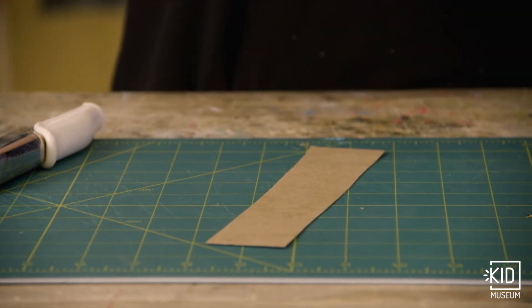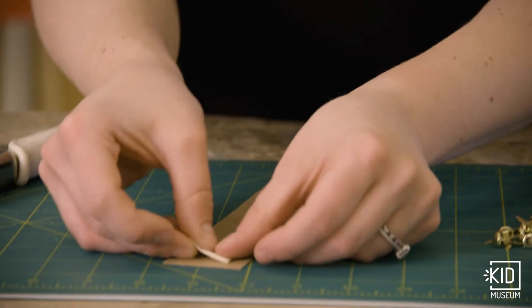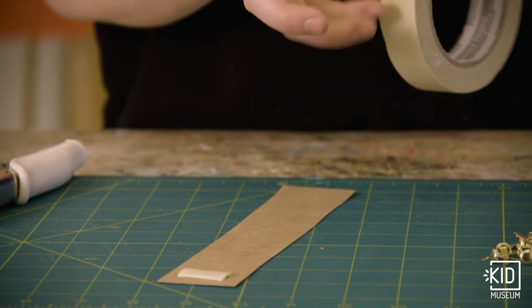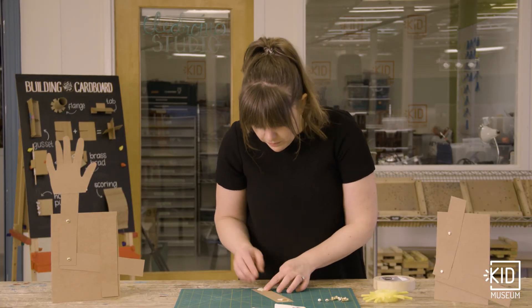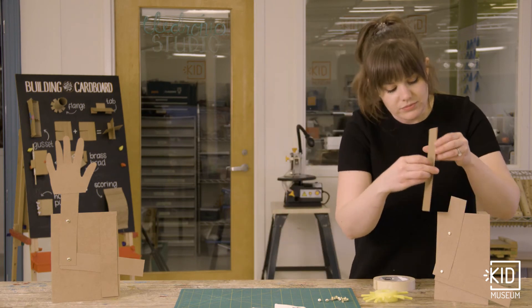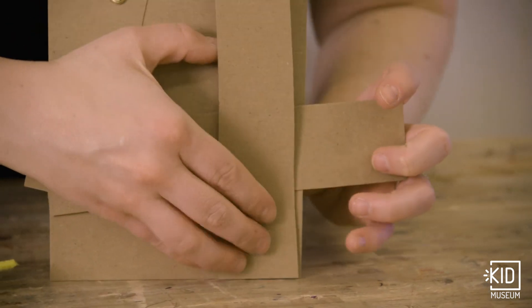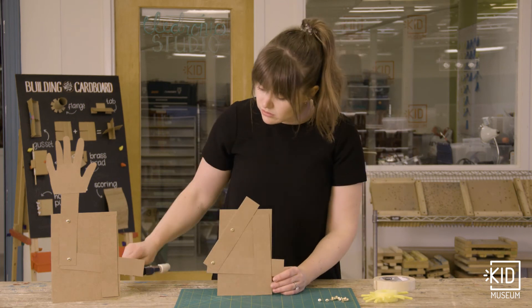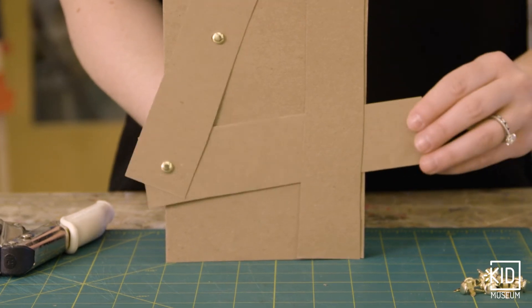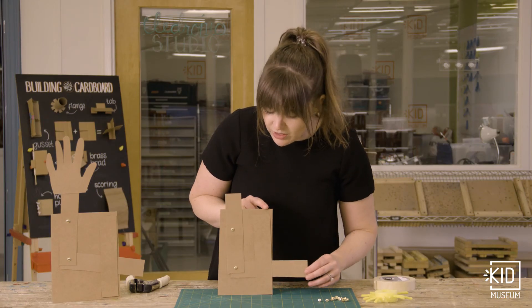You can attach this any way you want, but basically you want to attach the top and the bottom and leave just a window in the middle for the lever to move freely, and put one at each end. Then I'm going to hold up my lever and secure this end and the end above it. So now my lever stays in line and I can create that side to side motion on the top.